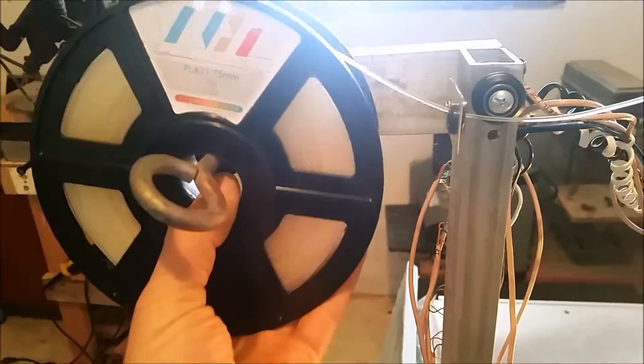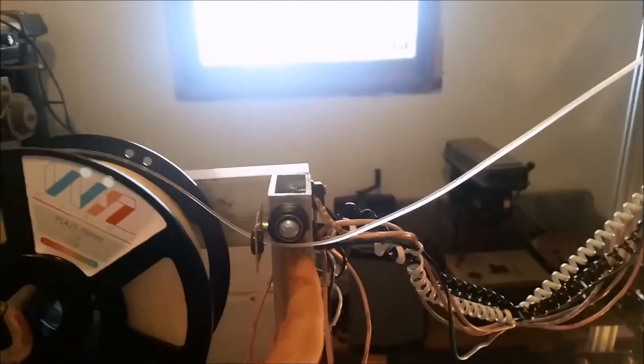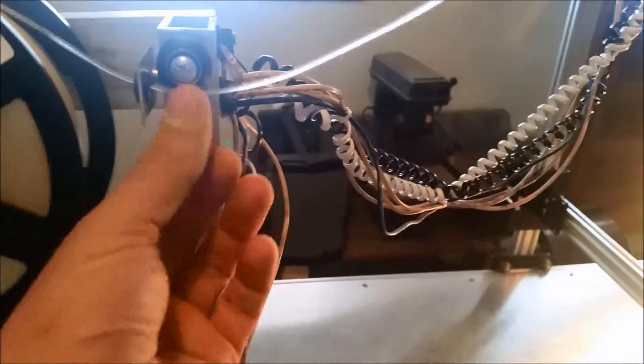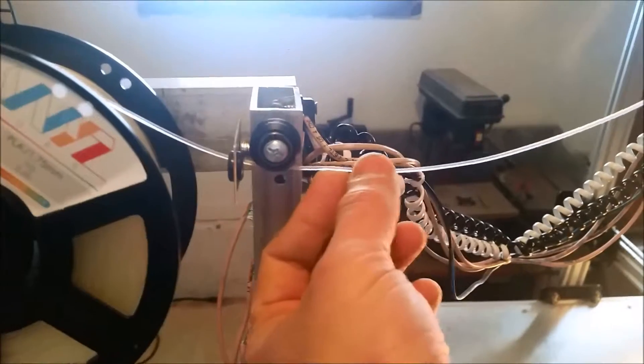This is still all makeshift and kind of slapped together. I plan on fixing this so it's actually on a roller, which will make things easier. What I'd like to do is, right here where this other hole is, put in another extruder motor — a NEMA with an extruder attachment on it, without a hotend — so that whenever the extruder feeds plastic through, it pulls out the same amount from here, and then that extruder is more than powerful enough to pull it through.